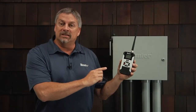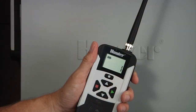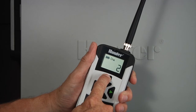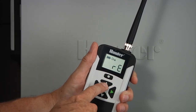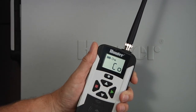If you're planning on using your Roam XL with an ACC controller, you need to change the mode from residential to commercial. To switch between residential and commercial mode, press and hold the mode button until the key icon appears and promptly press the right arrow button once. You can use the up arrow to switch to commercial or the down arrow to go back to residential. Once you've chosen the mode you wish, it reverts back to the home screen on its own.